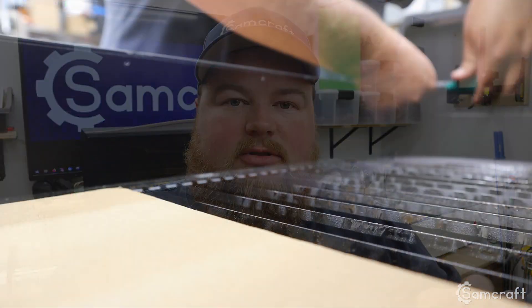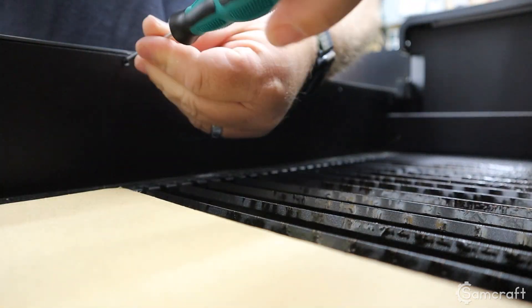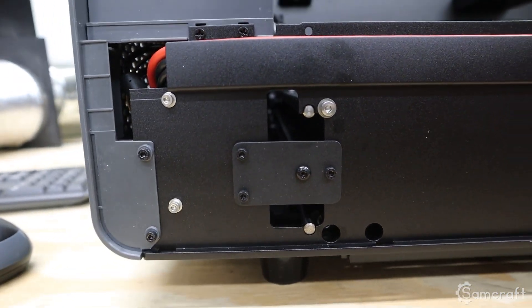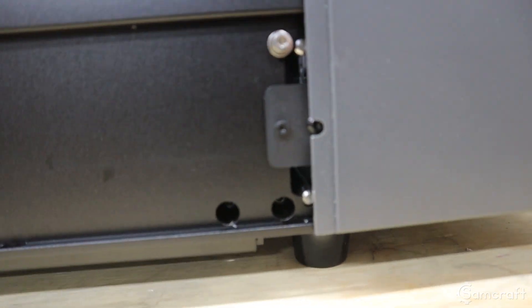What I'm going to do next is try and square up and parallel my gantry to the machine. For that, I'm going to turn the power off to my laser — absolutely turn the power off. Then I'm going to loosen the belt tensioners for my Y-axis; you have one on the left, one on the right. That should alleviate the strain, and I'm going to try and push or pull the gantry left and right to get it aligned. After that, I will re-tighten my belt tensioners, getting the tension as close to the same as possible on left and right side, then run the gantry back and forth several times by hand. To gain access to loosen the belt tension, you're going to have to remove the front lower plate of your machine. Right inside the lip of your laser there are six little screws that hold this plate on from the inside going out. Remove those and it'll carefully come out — you can pull it straight up and out. The reason you take this off is to get to the actual set screw tensioners built within the case, loosen the tension, and take all the slack out of those belts so you can freely move the gantry around without worrying about stripping gears, breaking belts, or damaging a stepper motor.